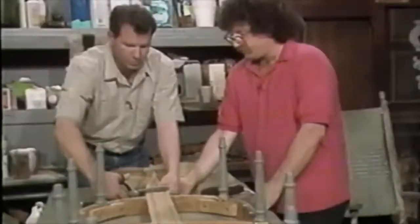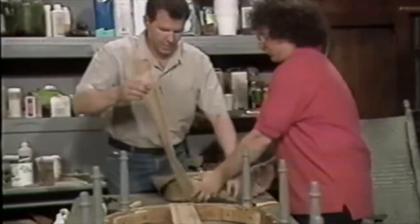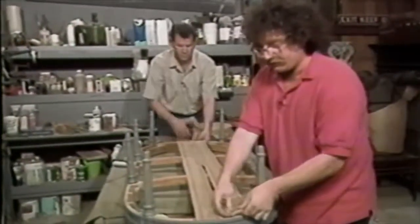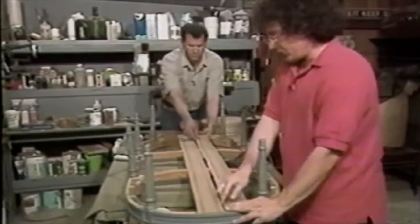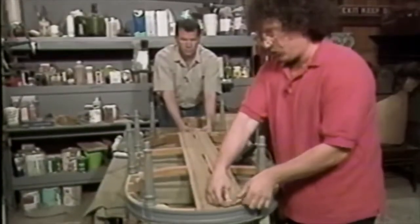With your very sharp shears, take the stretcher away and give a little snip. Then to finish it off, fold it over — and watch my fingers — it's very, very tight. Now we're going to do a second run. The only difference is we've got a curve here, so when we fold over, we're just going to fold over slightly at an angle, on the bias as we say. Remember, you want to leave enough room so you can weave the width-wise webbing through, but not so much room that you won't have a solid platform.